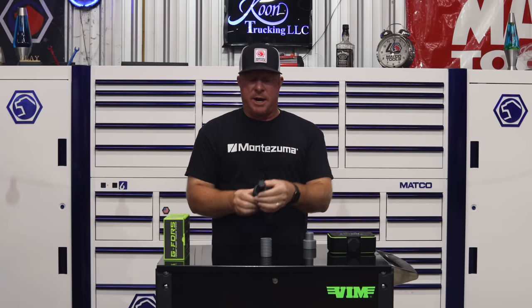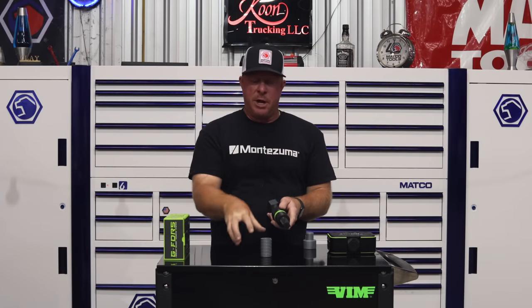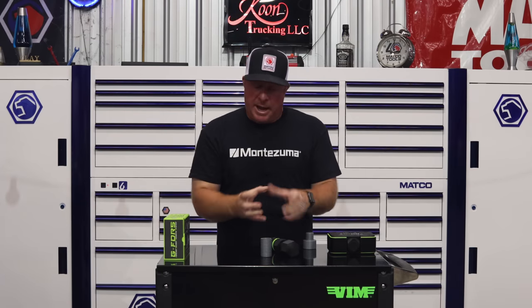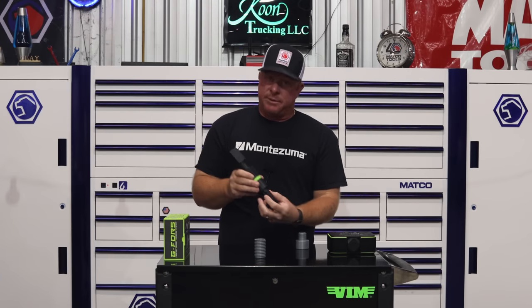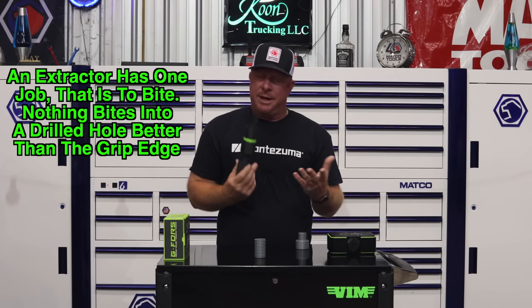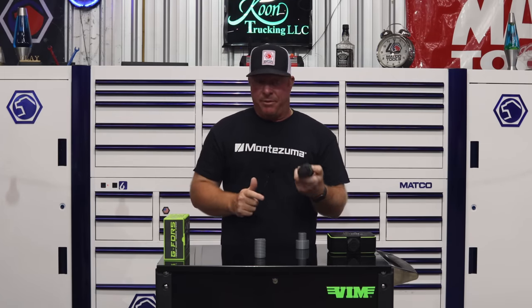One of the advantages of these extractors is the cut design. They are a straight extractor with a twist that allows it to bite and pull pressure to the center. You know how wedges work — that's exactly how tapered extractors work in real life. A tapered extractor pushes inward and pulls pressure outwards, effectively binding the threads against whatever it's attached to, making it even harder. These straight-cut fluted extractors have superior biting ability and are hands down the best extractors on the planet.